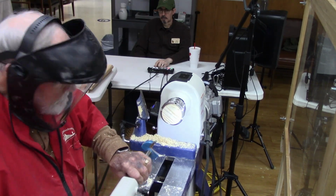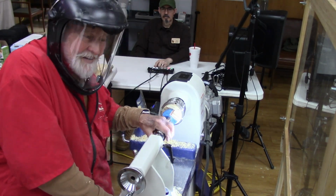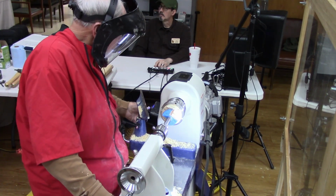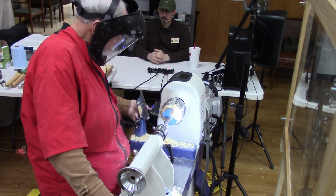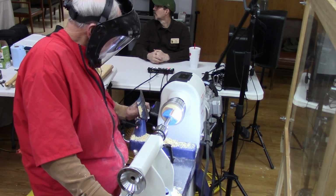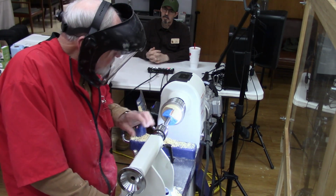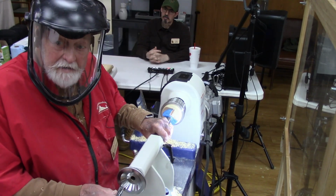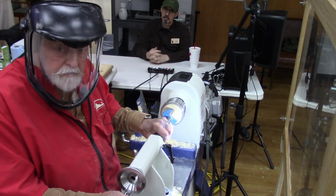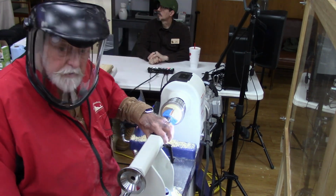That's up to you. Good, I can see the bit. Now I see it. And you're supposed to slow your speed down when you use a Forstner bit, to about 300. I do a little bit better here than I do at home. I run it pretty fast at home anyway. Gary, a question from the audience: what size is the drill bit? I think it's 2 3/4. I've got it marked here. It's 2 3/4.